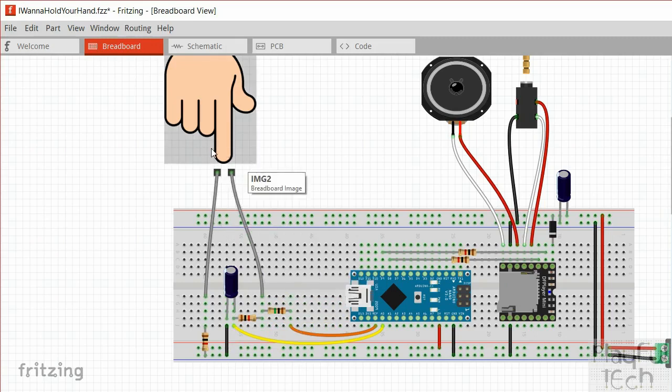Now let's say that the resistance here is increased. So let's say it's 2 megaohms here instead. Well, what we now have is a third going down this path here and two-thirds going across here. So we'd now expect to get a reading of 3.33 volts, for example.